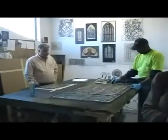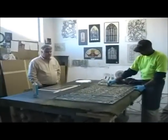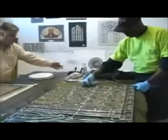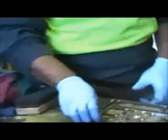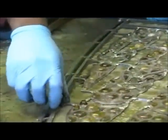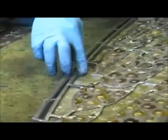We're closing our puttying area, and this is one of the windows from Cincinnati. We are using what we have here as our organic glazing compound, which is a charcoal color putty mixed with soya marine oils. Tony is embedding it underneath the lead caming. This will be done on both sides of the windows. We will then press down the leads in the areas to encapsulate as much putty underneath as we can.